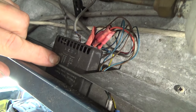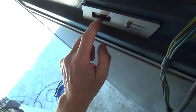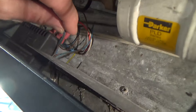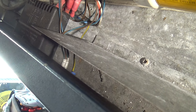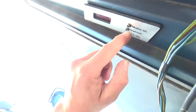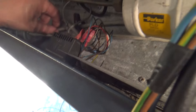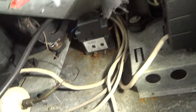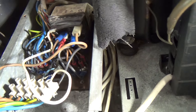That says feeler or sensor or something. And then we've got AC 12 volts, so this is just a temp display. And then we've got probably two LEDs — live and neutral — or whatever it is, three volts and whatever, and ground, twice that, to do these two lights for mains on and defrost. So on the end of this cable would have been a controller of some description originally. That goes into here.